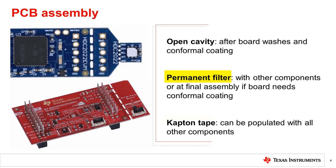A package with Kapton tape can be populated at any time in the assembly process. Since the tape is removed in the final stages of assembly, it will provide protection from chemicals used to wash the board, and any conformal coating placed on the tape will be removed once the tape is taken off. Solder reflow is another aspect to be mindful of. Not all soldering processes complement the performance of open cavity ICs, and for that reason we recommend using no-clean flux and no wash when populating our relative humidity sensor.